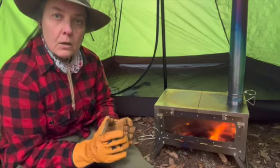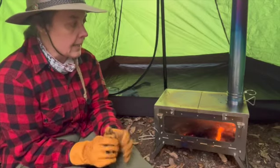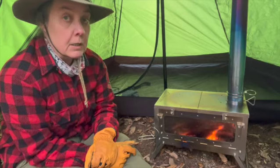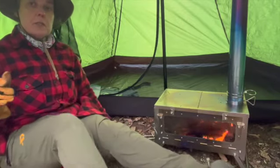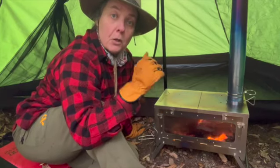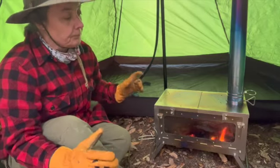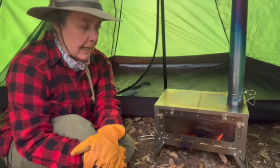Going good like this, you can see through the window. Here's what you want to keep your eye on: this collar right here. If that starts to glow a little bit red, don't panic — everything's okay, it's metal. What you're going to want to do is close the damper down to a 45-degree angle, and close the vent so it's just a little crack. We're going to let this come up to temperature and then do that.